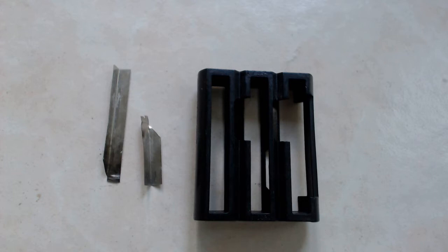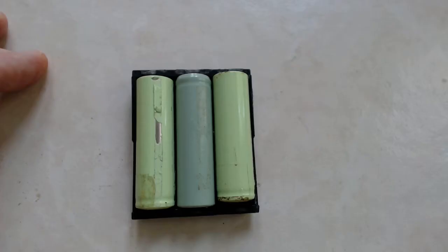If you take an old battery apart, you'll note the batteries are connected together with spot-welded strips to the ends of the batteries, and there were two runners that made contact. Unfortunately, the material they used can't be soldered. You really can't adapt a standard foam battery pack because in a standard foam battery pack the batteries are physically attached to each other. There's a slight gap between batteries in an HP battery pack, so the connecting strips would still be slightly too short to work in the original plastic encasement.